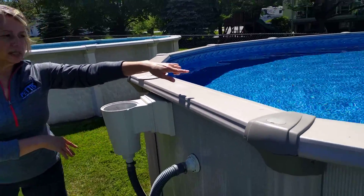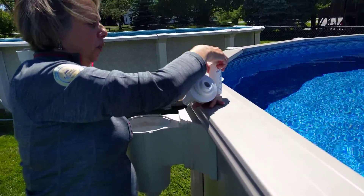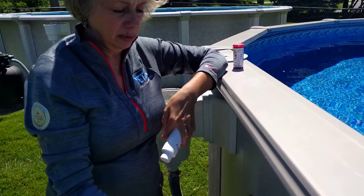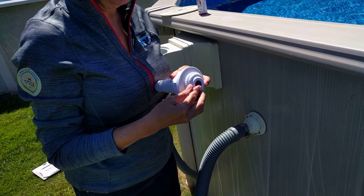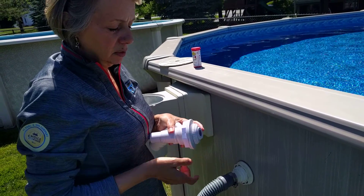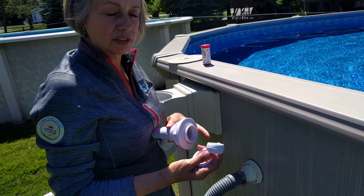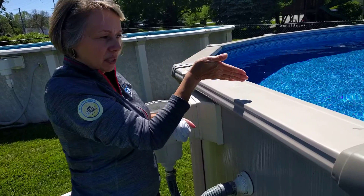While we're up here, we're going to look at the top of the pool really quick — Zach's going to zoom in on here for me. You'll see ripples on top of the water there, and one thing we don't want to see is ripples on top of the water — that means the return jet is just not angled properly. We want to make sure you have movement on the top, but you want movement at the bottom of the pool as well. This is what the inside of your return jet looks like against the wall — it's pretty easy to adjust. You're just going to turn this little circle on the inside, get your fingers on those eyeballs. What we're looking for is 45 degrees away from the skimmer and angled down just enough so we get rid of those ripples on top of the water. Angle that eyeball where you like it, tighten that back up — should be good to go. You might have to take a couple of shots at it. Just be careful if you do it too loosely, that eyeball is going to fall out and you just have to fish it out of the bottom of the pool. So just get those ripples gone — 45 degrees, angled down just a little bit.